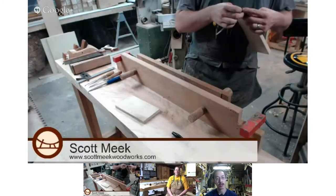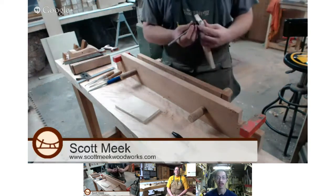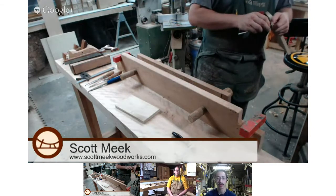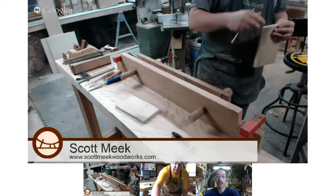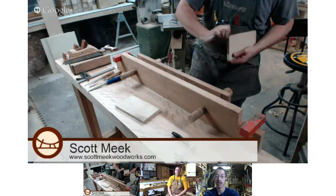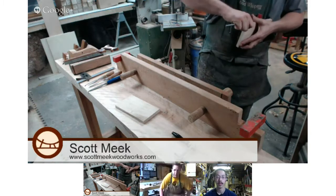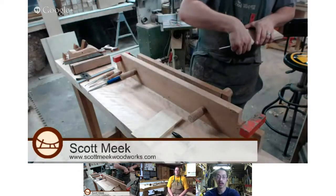That's a very narrow-looking bench there, Scott. It is a very narrow bench. This is my new travel bench. Oh, I was going to ask if you had gotten that built already. Yep. So the legs drop off? They're bolted on or something? Yeah, I just got some heavy-duty screws. So there's screws through the tenons into the top. The rails are half-lapped onto the legs, and screws just holding those on. And so it can all come apart. This will be what I take to woodworking shows.